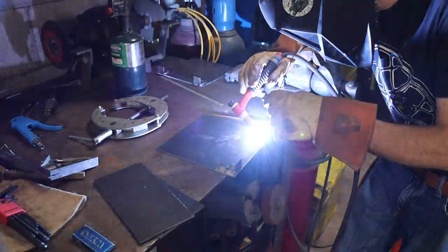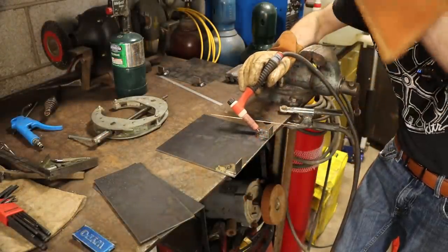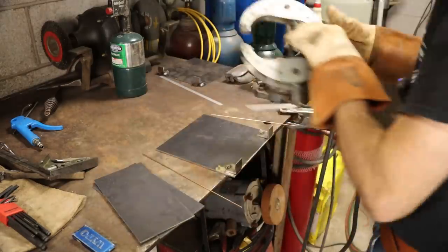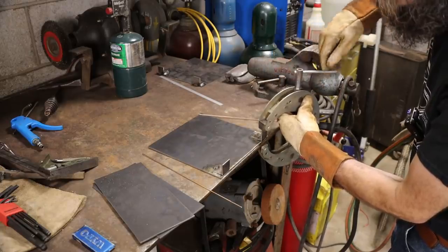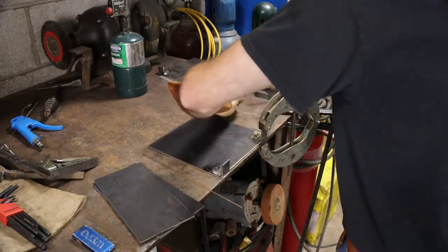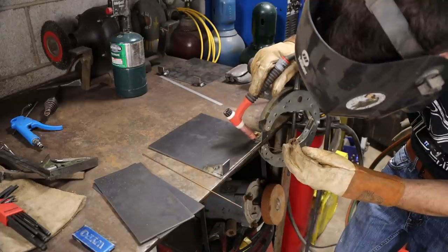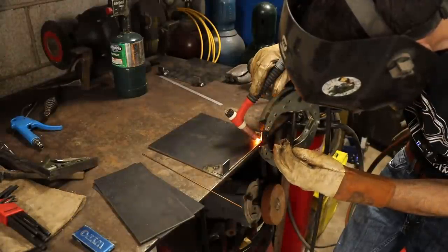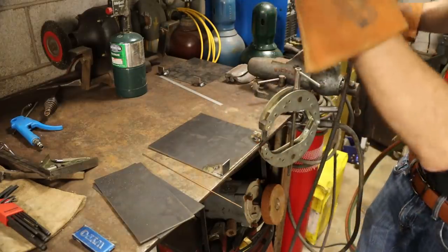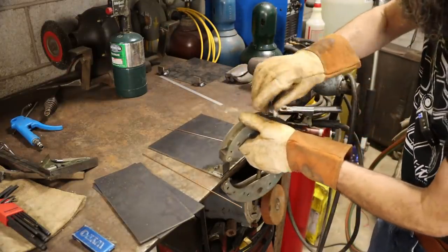The only feature that this welder has at all is high frequency start. That's it. I'm hoping to get AC/DC, you know, the capabilities to weld aluminum, one with a pulse feature, and on and on, right? There's so many features these days that are useful that I don't have access to with this welder that hopefully we'll get to upgrade before too long.